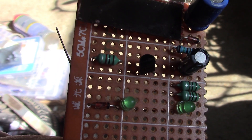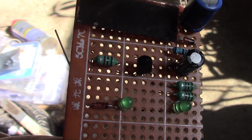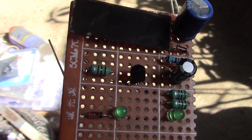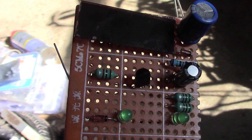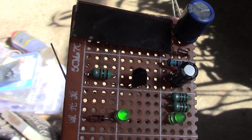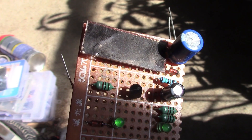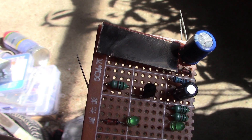It's working. What I've got going on now is I've disconnected that top-left inductor and just got the other two in the bottom right, and it is doing the flashing thing which it's supposed to do - very interesting. It's only doing it in a certain range of light though - if I put it straight into the sun it doesn't do it, but bring it back some and it does.